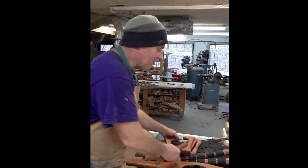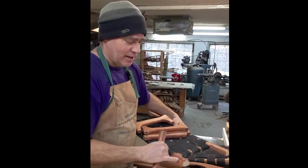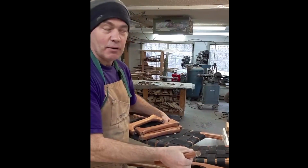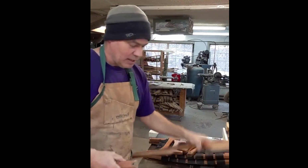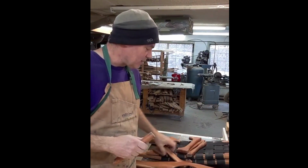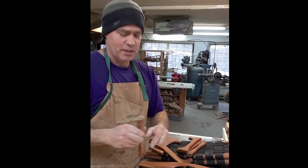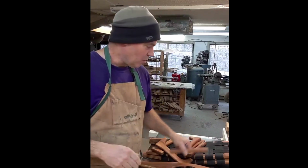And you'll see that often on the ends of your seats, where the holes that have been drilled through for the seat trusses or hangers start to rot out and the seats just fall apart. So get them dipped right in: your yoke ends, your thwarts, your grab handles, your seat butt ends, and let the oil really soak up into that end grain. And 2 or 3 coats like that, and you're going to do your canoe well. It's going to last a lot longer, your wood components.